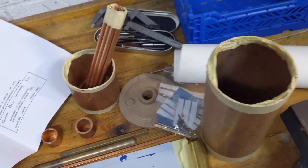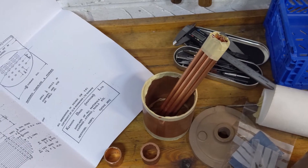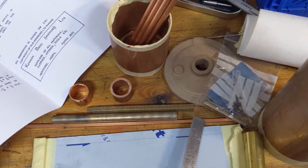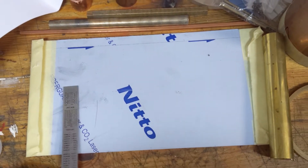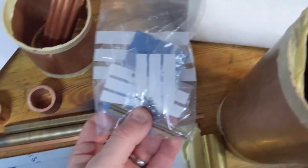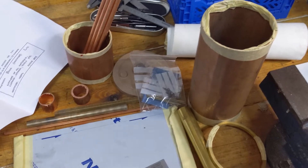So it's a quick overview of the kit of parts: got the main boiler barrel, the inner firebox boiler barrel bit, top casting, a few bits, lengths of stock for bushes and whatnot. This square piece is the firebox ring at the bottom. This plate here is the copper plate from which we'll get the two tube plates - the top and the lower tube plates. Also a chimney, a bag of odds and sods - screws and little bits for the fire hole door and things. And we've got some lagging with mahogany inside and the brass banding.